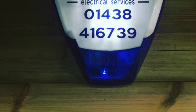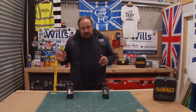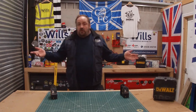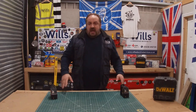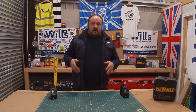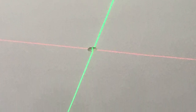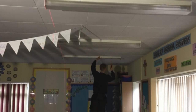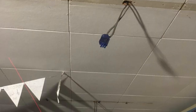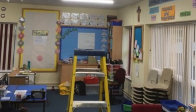Another really good way — if I'm plotting anything and I'm on my own — is that a lot of people always plot the ceiling, but the floor is exactly the same. Sometimes what I do is measure the room, then plot them out on the floor. If it's a furnished house, I'll probably do a mark on the floor and then just run through it. It's perfect because whatever matches on the floor matches with the ceiling. Sometimes that works out better — it's a lot easier than getting up your steps and marking the ceiling.